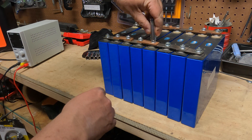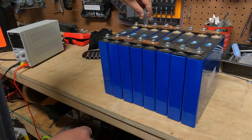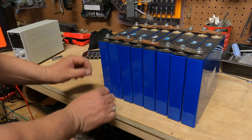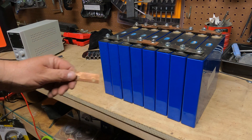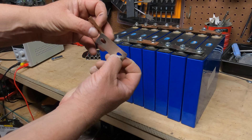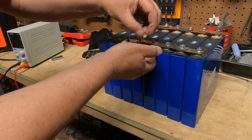When you buy battery cells they're going to come with bus bars, but they're not going to come with enough — that's why I have these homemade bus bars. It will come with enough to make it series, just not enough to make it parallel. Mine are ugly but they're actually better because they're pure copper and considerably thicker, and they're not hard to make. In fact some people make them out of copper pipe.